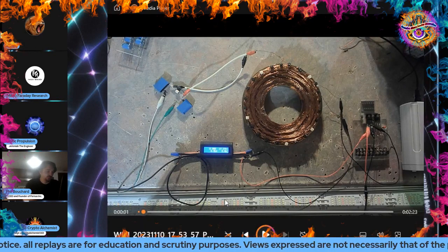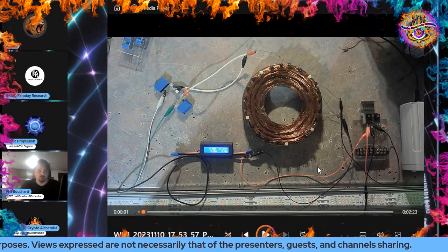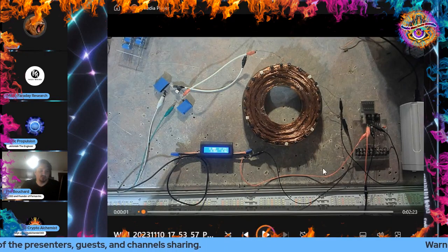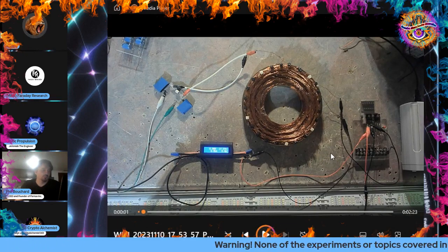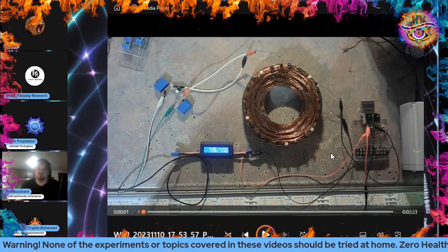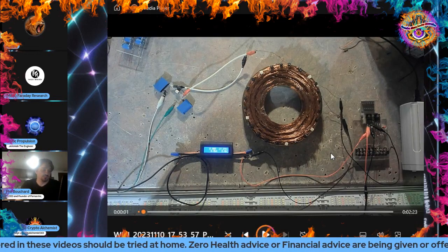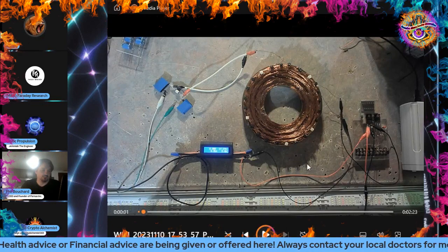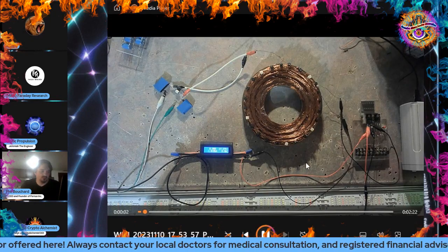At the bottom of the screen here, this is an LED grow light beam. It's 150 watts, and I'm going to light it with 27 volts, 261 hertz, but with a 2.5% duty cycle, just at first. It doesn't light up bright, but I'm going to incrementally go up from 2.5% duty cycle to 5%, then to 10%. And then I'll show you my max 50% duty cycle, and you'll see the difference. And watch the watt meter.